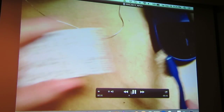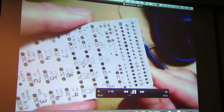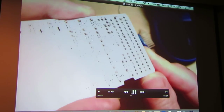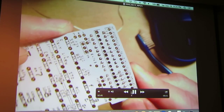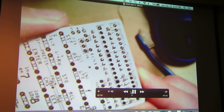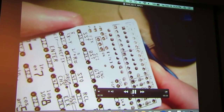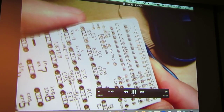When you build these, say you've got 10 or 12 — do you build board by board, or do you line up your 12 boards and put in all of this chip and all of that chip? I usually sequence — I try to build all of the ICs at once. And I'm really picky about the displays. That's the first thing you're going to notice if the display doesn't line up, and that probably takes me the longest of anything on the whole board, except for the 32 switches and the 64 solder connections.